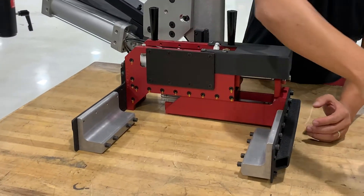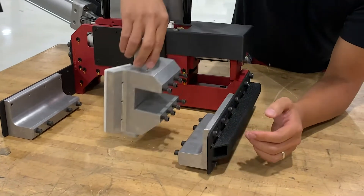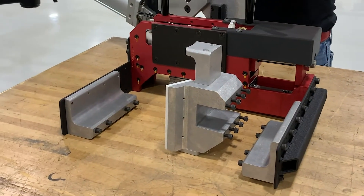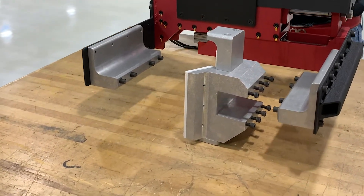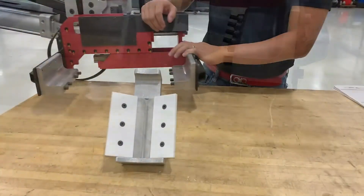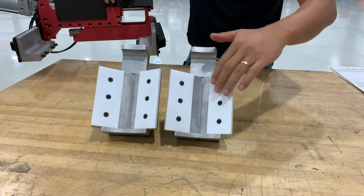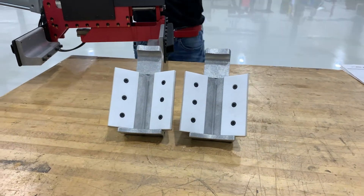The part manipulator includes two sets of fingers for two different parts. One has a carbide tipped gripper which provides a secure hold and locates a slot inside the customer's part, and the other uses a set of fingers that has Teflon pads on it to protect the surface finish on the part. It also has a V-shape which assists in making sure that we fully encompass the diameter of the part. From the top and bottom caps on the fingers, we ensure that the part does not slide out.